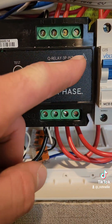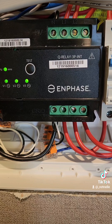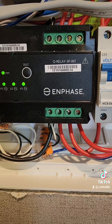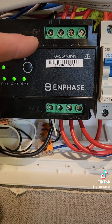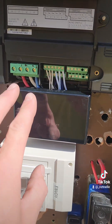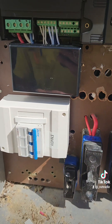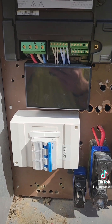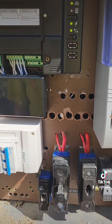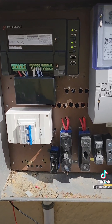Here is where AJ tested our reference, and we've just had a look in the main switchboard, and it's going to be easier to change the phase reference on the Envoy rather than in these switchboards. So what we're going to do is turn this off, switch those around, which will actually align with these properly, and check the consumption CTs here, and it should be all sorted then. We just checked the production CTs, and they are fine like they are.